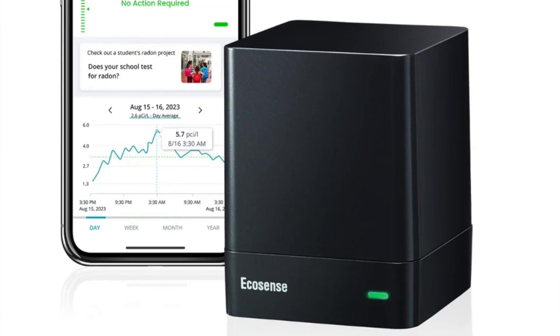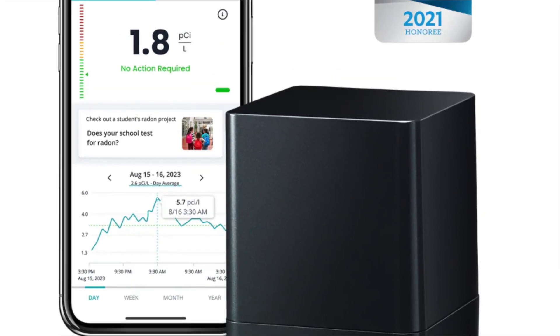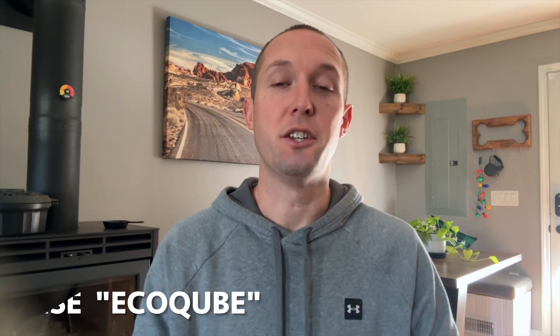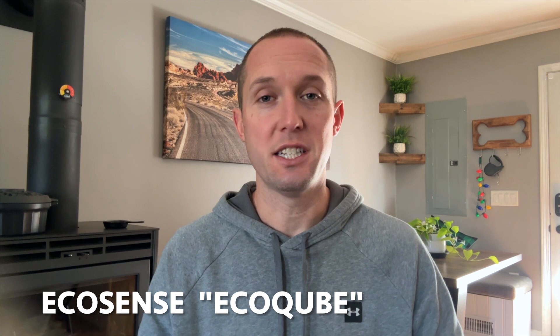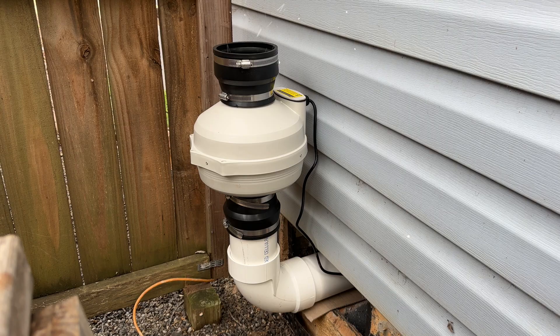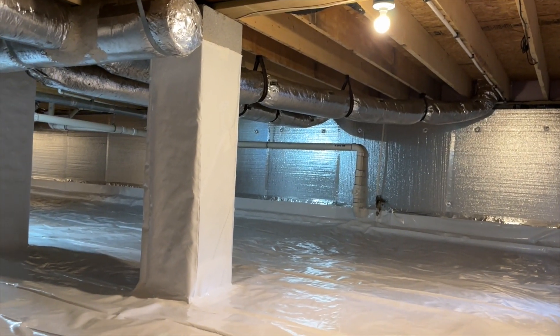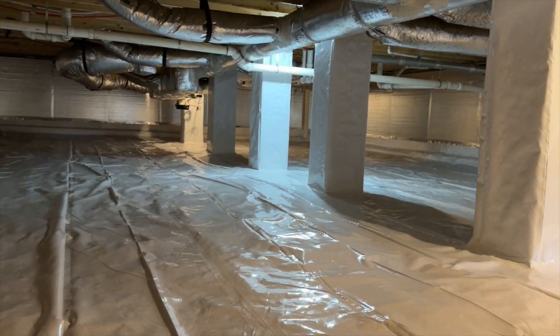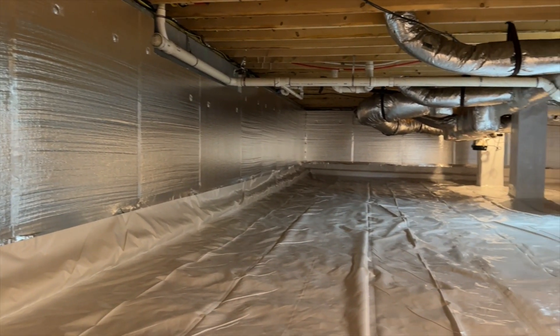It'll keep soil gas from coming up. If you have radon — and we do have a little bit here — I'm using a long-term tracker made by Eco Cube. That's how we were able to know we even had radon in the house to begin with; I'll have a link in the description. To actually mitigate radon you're going to need some kind of fan pulling out from underneath the plastic or venting directly from the crawl space. With that said, let's jump right into the steps I took to get this crawl space properly encapsulated.